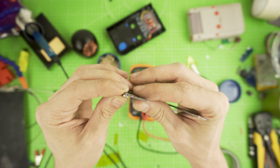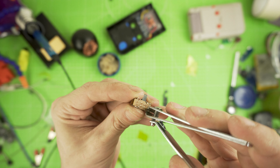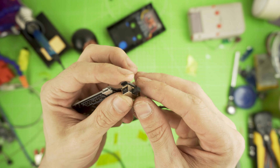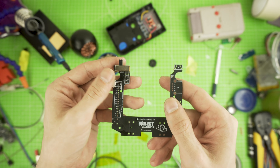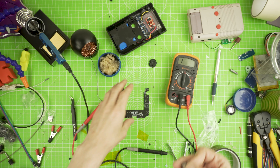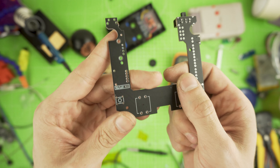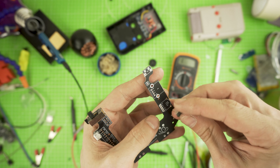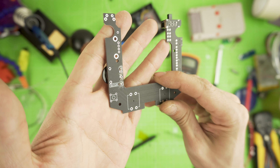We can go to our switch. We will have to clip the four legs with a clipper or clamp. Once done, you should have just the six pins sticking out. Add this in its place and solder it down, then clip the pins flush and we've got the switch in place. Next on our list is the volume wheel. You can use either a 3-pin or a 5-pin volume wheel. To use the 3-pin one, you need to jumper the two parts together. Place it on its holes and solder it down.